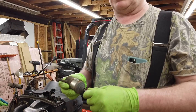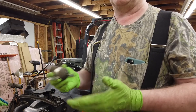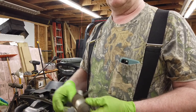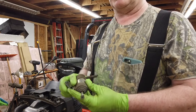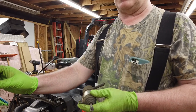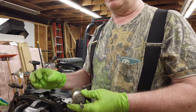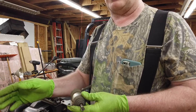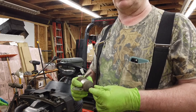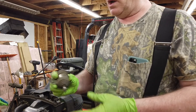Solenoids are how many things function — your car has a solenoid in it. When you turn the key, the solenoid gets energized, a gear on the starter goes out and engages the flywheel. That small gear spins and turns the engine over until it fires. In fact, this Kubota has two solenoids: one on the starter and one here to shut the fuel off.